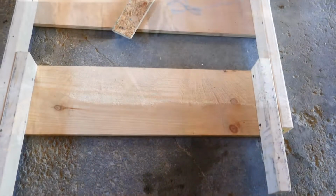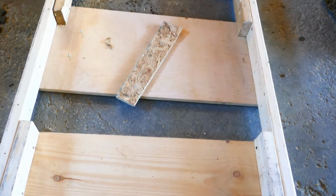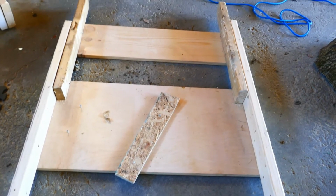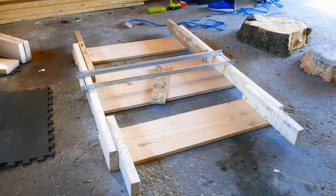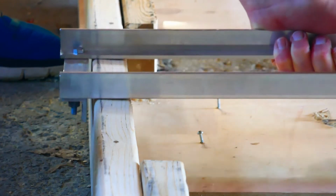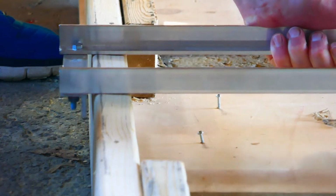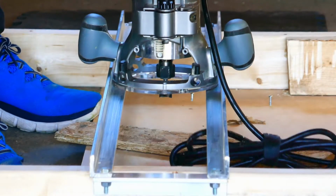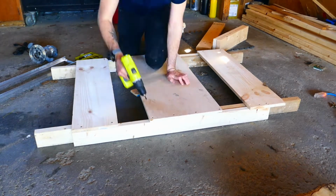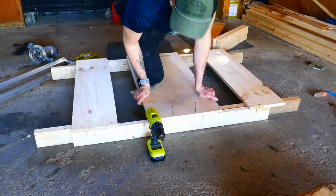To flatten my slabs I use something called a router sled. I made mine from a few scraps I had lying around, some 3/4 inch plywood and some 2x4s. The 2x4s act as rails for the sled to slide on, and the sled is made of 1/8 inch L-shaped aluminum, and the router slides back and forth along that. You can make your sled as big or small as you want, depending on the size of the slab you're flattening. Mine's 3 feet by 4 feet. I find this works well for just about everything. I use metal for the sled, as it doesn't bend very easily and gives you a more consistent depth of cut. I use wood for the rails, that way if I accidentally hit them with the router bit, I won't damage it.